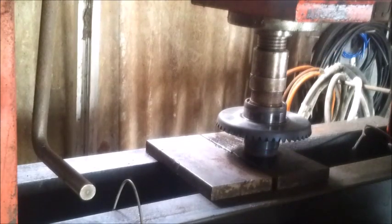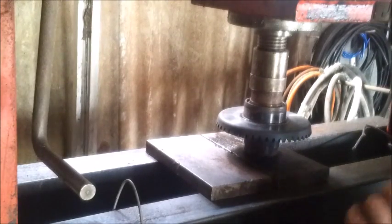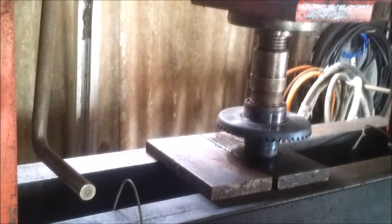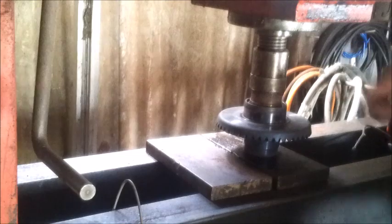When I was hammering, it's still quite hard, about 4140 with the spline, and I was just using a piece of mild steel head on it, so it might have looked a bit violent, like you'd spread it over, but it never was going to, and it didn't. When it cooled off, I fitted the part on, and it still fits. It was a little tighter, but we allowed for that. Anyway, we just got to spin that off, and maybe I'll run a little bit of weld in there too, just to tack it in a couple of places. We'd like to weld it all the way around.